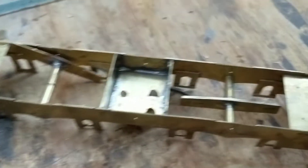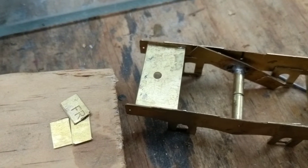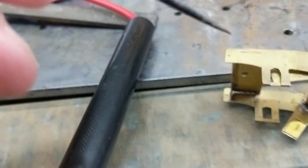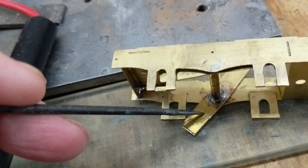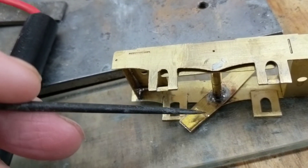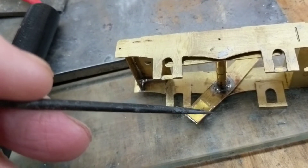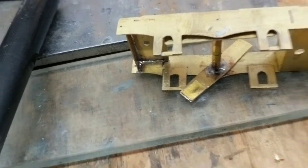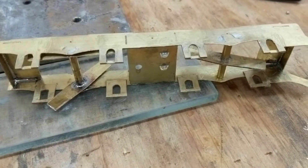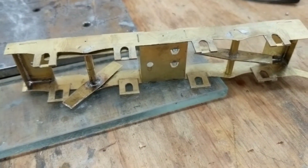This one here is double - that's two together, these are single. What I've just done - just from an engineering point of view - I will solder on, I should have done this before, but it doesn't matter. I'll double up the brass so it's got double the bearing surface here. Whether it's necessary or not I don't know, but I suppose it's a bit Brunellian, a bit over-engineered perhaps.